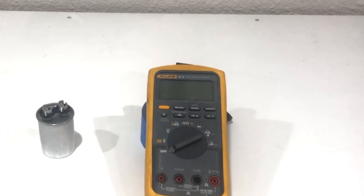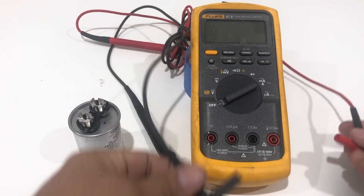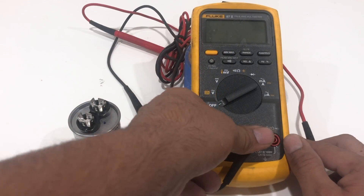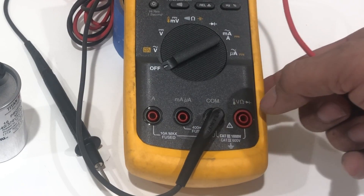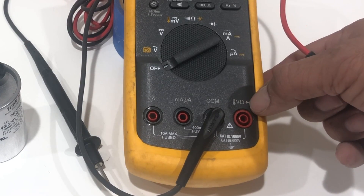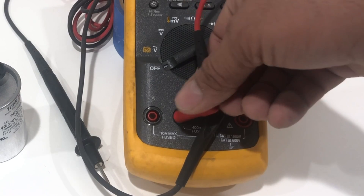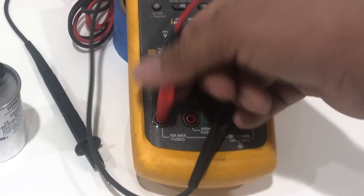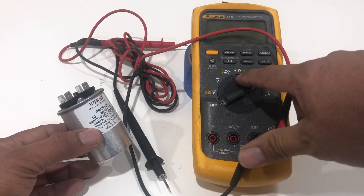As you can see, there are some symbols — white ones and one yellow. I will show you in a minute what those are for. First we're going to set up the multimeter. To set up, first we are going to put the probes on the multimeter. Black always goes to COM — as you can see, there is only one black spot. There are a couple of red spots; you can put the red probe in three places depending on what kind of test you are going to make. The first is for temperature, voltage, ohm, and diode. The second is for milliamp and microamp. If you're testing more than milliamp, you put it on the amp-only port. In this case, we are going to test a capacitor, which is related to ohm, so I put the red probe in the ohm spot.